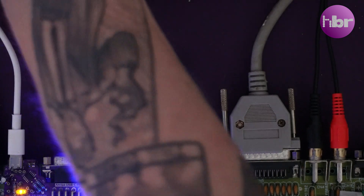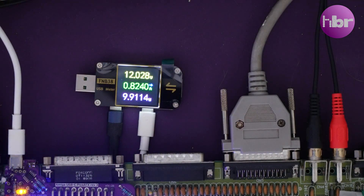Clicking the power switch, the Amiga bursts into life. With a Gotek connected it will boot, and we're pulling around the 10-watt mark — not even breaking an amp at this point. I suspect if we gave the Amiga more to do, or used an original internal floppy drive instead of a Gotek, we'd probably see it get to maybe 1.2 amps. This does suggest the original power supply was probably a little over-specced, or maybe wasn't quite as powerful as it claimed.